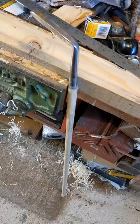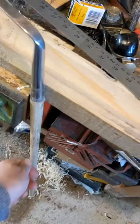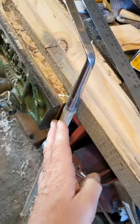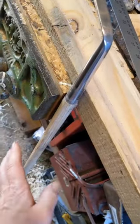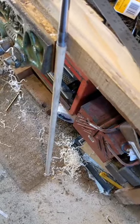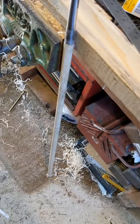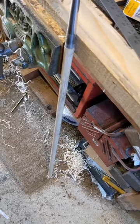The reason being that what I'm going to do now is take the hand plane and work predominantly this section of the shaft to a slimmer diameter, and I'm going to be feeling it periodically for the flex and just how whippy the shaft is turning out. And also periodically I'm going to put it onto my swing weight scale, which is here.